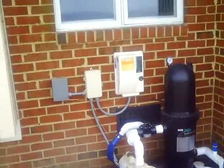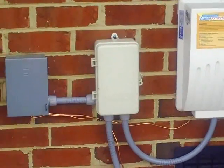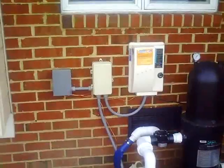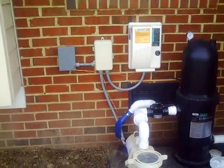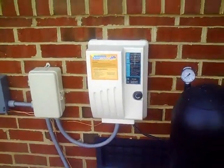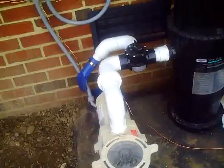Look at our pool equipment here. You'll notice that this little vanilla box here is our pool pump timer. Our electricity is coming into that timer — in this case it's a 30 amp dedicated circuit, 240 volts. And you'll notice that from that timer there are two whips: one going to our saltwater chlorinator, and the other one going to our pool pump. This is done for a very specific reason.